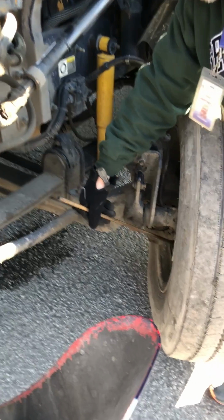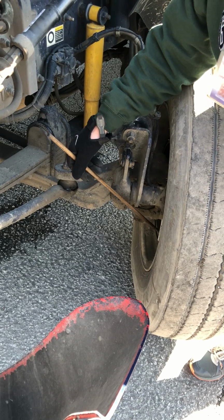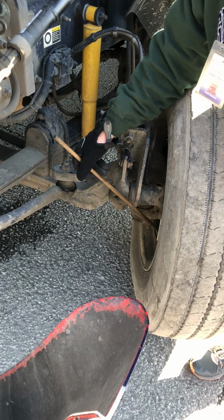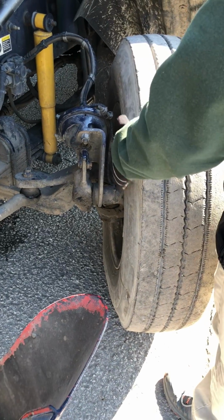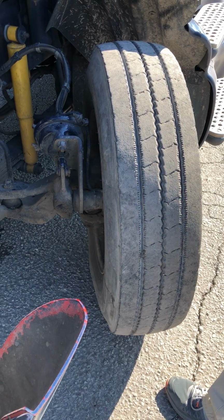I go to my brake drums and brake linings. They're properly mounted and secured, not cracked, damaged, loose, or leaking. There's no debris or oil in between my brake drum and brake pad, and they're not worn dangerously thin. My pads aren't. I'm going to go to the sidewalls on my tire. It's properly mounted and secured, not cracked, damaged, loose, or leaking. No abrasions, bumps, or cuts on those.